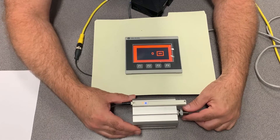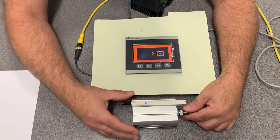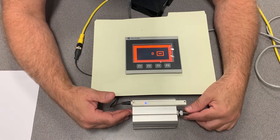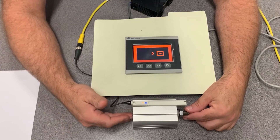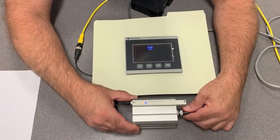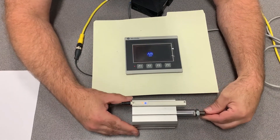The DMP series actuator positioning sensor is very efficient, reasonable in cost, and easy to install. Like I said before, it fits right back in the standard sensor groove with no modification needed. Typically you would have to bore out the cylinder and buy a transducer from somebody else to put in — that has quite a bit of cost — and this gives you exact feedback on the location of the rod to the PLC.